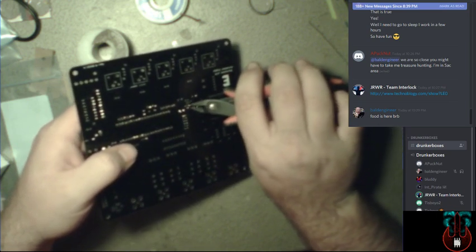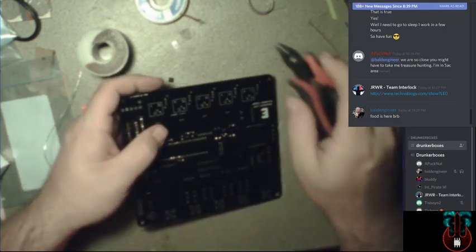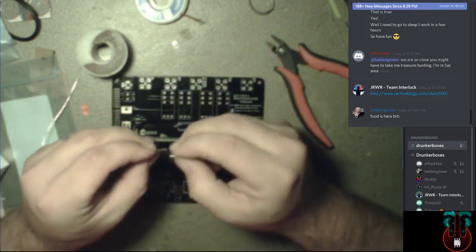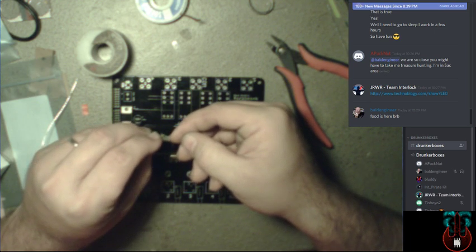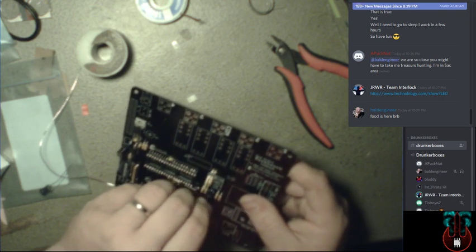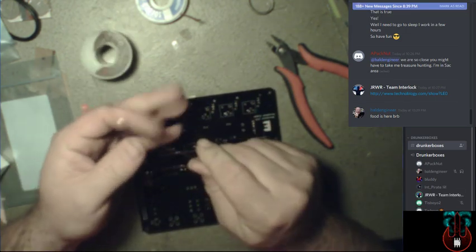Something else I was going to do. Since I'm making a badge for a security conference, I was going to set it up so that there are 2 pins connected to the shitty add-on port, pin 0 and pin 2. If you short one of the shitty add-on pins to VCC on boot, while the microcontroller is booting, it'll change modes and give you different animations. But it'll only work at boot because you can't really switch them out that quickly. That was just an idea I had when I was mucking about with the code. I can do different branches of animation if the pin is pulled on boot.